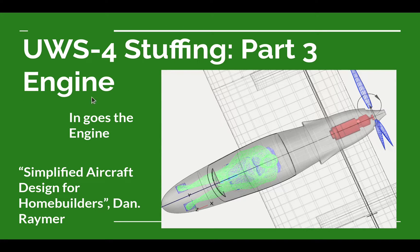One of those things is the engine. The cowling around the engine is going to have an impact on the aerodynamic design — how you cool the engine, the size of the openings, and the input and output can affect the drag of the airplane. The segment of the chapter covering the engine is called 'In Goes the Engine.' Let's get to it.